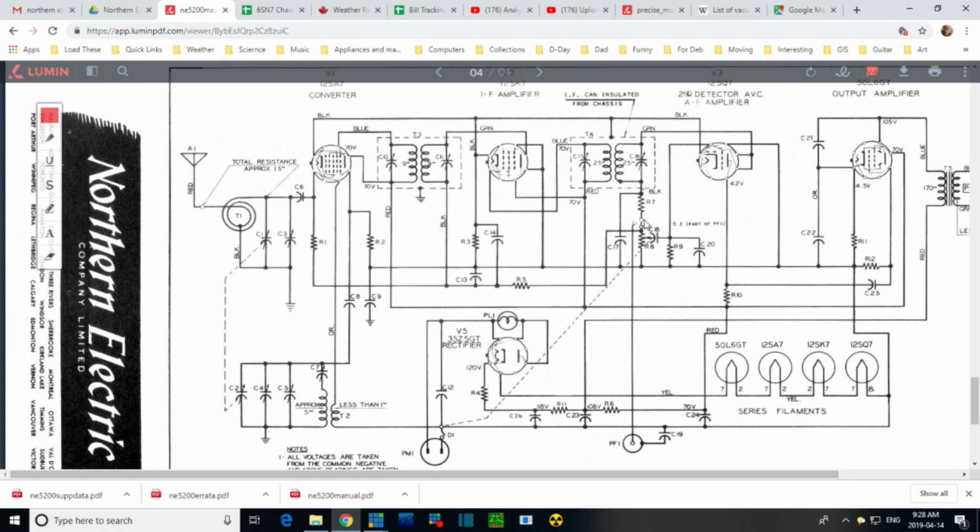And what you hope will happen is you'll somehow kill the radio signal coming out of here. Part of that would be tuning the radio off at powerful stations, so the radio is not producing much, because the radio's output is still heading for the speaker, and along with it, it's just picking up the phono here. Unless this is some kind of switch. Occasionally these phono plugs are designed so when you push the plug in, you operate a switch. I wonder if that's the case. Okay, I got a couple things to look at.